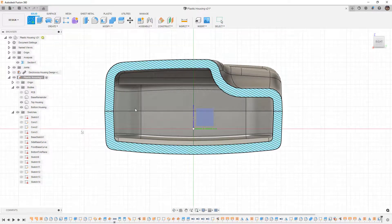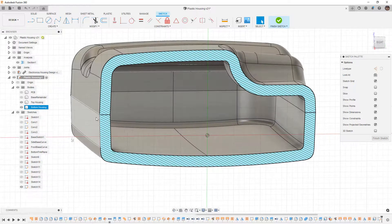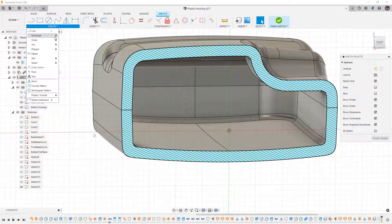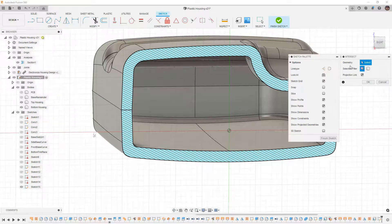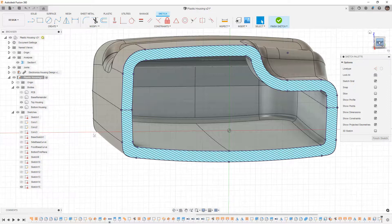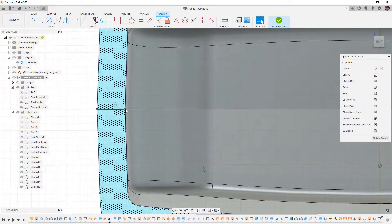For this video we're going to focus on creating the groove between the two bodies. We're going to start with a sketch on the right plane, the YZ plane. We've already sliced through, but we want to intersect some of this geometry. I'll go to Create > Project/Include > Intersect, and select bodies rather than individual entities, bringing both bodies in. This gives us a reference for the inside and outside edges and a midpoint along that edge.